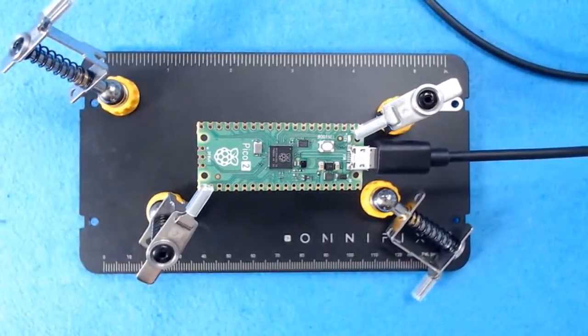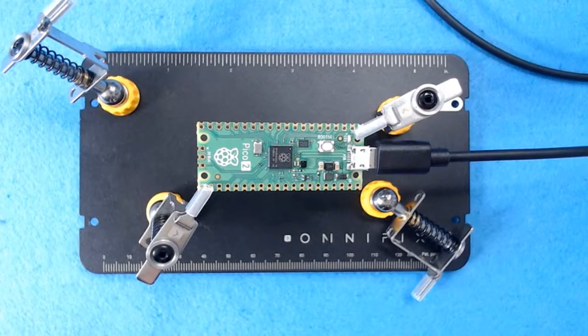One of the things I love about MicroPython and CircuitPython is that your code is stored on the board in a very readable fashion. You can just look at it like a flash device and take a look at the code that's on there. So I'm going to do something I usually do, which is copy everything on here and dump it into a folder in my project folder. I'm going to call it Pico 2 original files and take everything that was in that device, including some hidden files, before I change anything, so that I can hopefully get back to a working state if anything goes wrong.